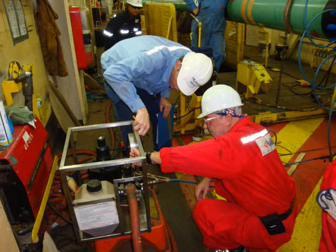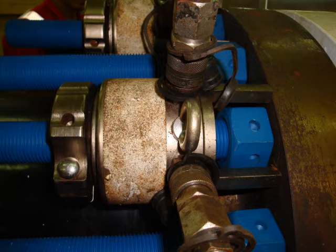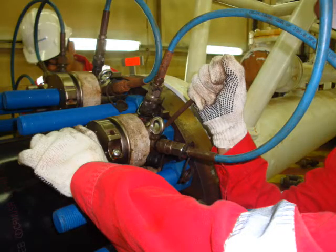The hydraulic pump. The hydraulic jacks push against the flange face and the reaction nut, and since the reaction nut is screwed onto the bolt, all the resultant load is transferred to the bolt, stretching it axially. As the bolt is stretched, the hexagon nut lifts from the flange and can be turned manually with zero torque. By applying a Tommy bar through the slot in the bridge of the hydraulic jack into the purpose-built aperture in the nut,